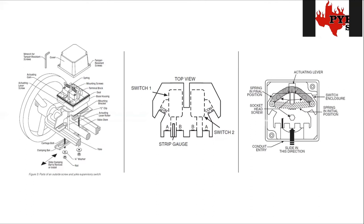There's not enough room inside these devices to put the monitor module inside the box itself. We typically just pull a wire out and put the resistor out here. The monitor module goes back in a junction box mounted to the side of the device or on the wall. If this is on a post indicator valve, the monitor module will be inside the building and we're just running a wire out to the PIV valve.